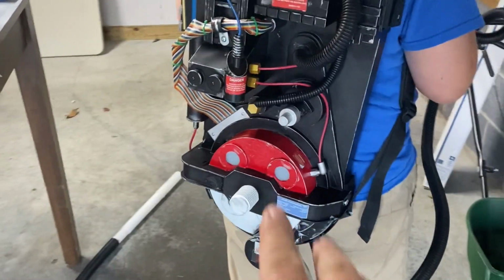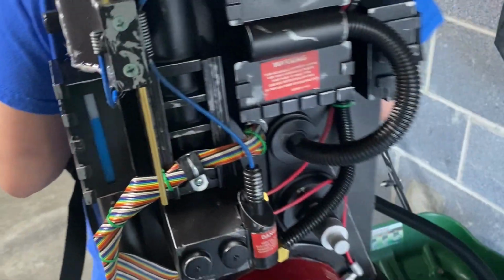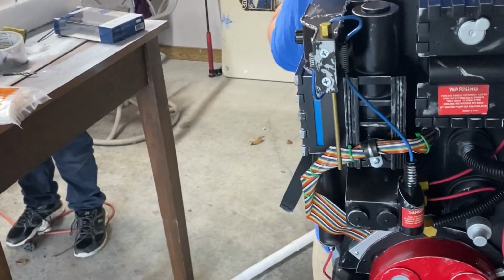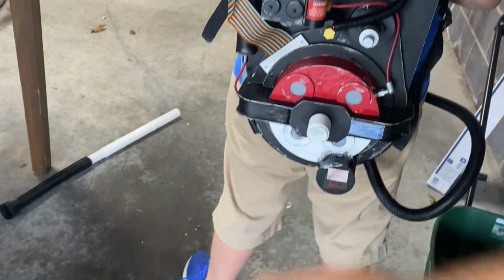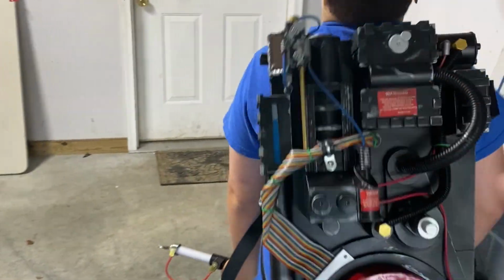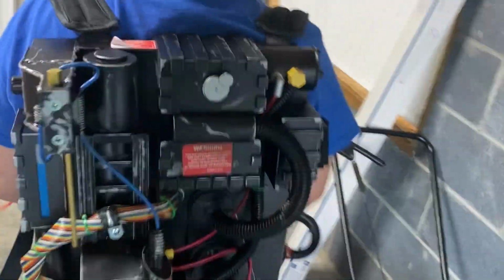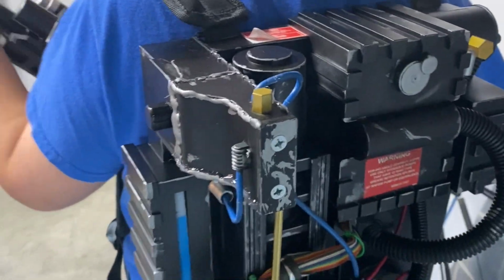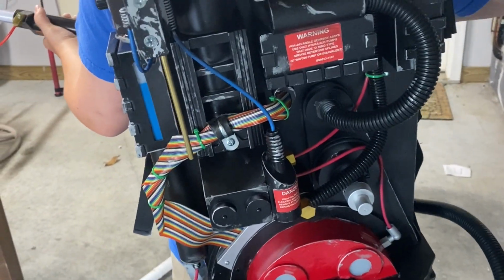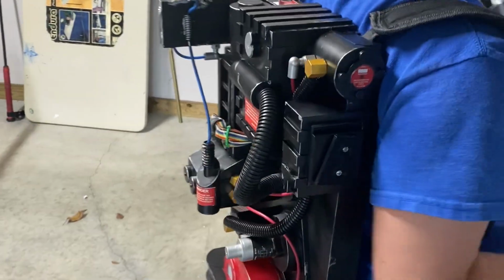Once we get the lights in there, we just got our Arduino this week. We're going to do a light for 4 of the main colors of energy. Red for fire, blue for water, green for leaf, and yellow for lightning. When that cyclotron spins, it's going to spin up those lights that way, and then we may do the same cycle up here on the bar graph, and there's 6 up there. So we'd have 3 colors. Water, we may do something different up there, but I feel like that turned out really well.